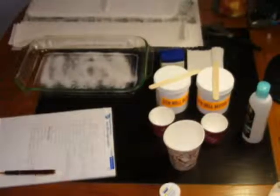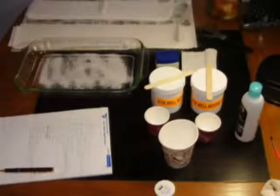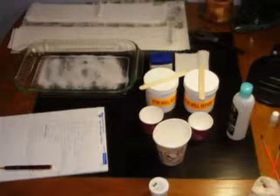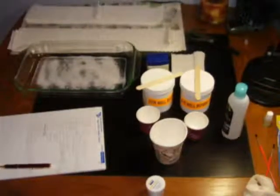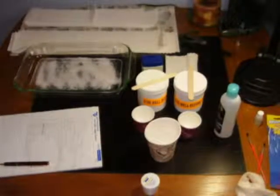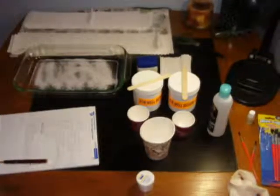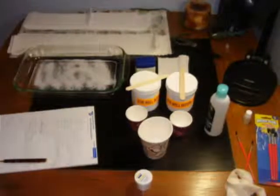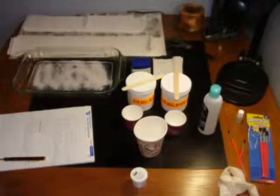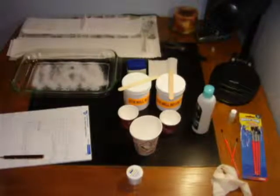The first step is life casting. These are some of the materials I used: plaster bandages, a tray with salt, and a Body Double from Smooth-On. This is the trial size kit. I heavily recommend getting the thinner for the splash coat, which I did not do. I also thoroughly recommend keeping the room at the recommended temperature, otherwise it will cure up so fast you won't get it out of the bucket and onto the face.